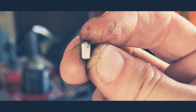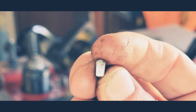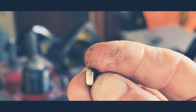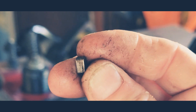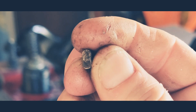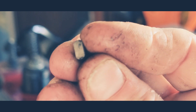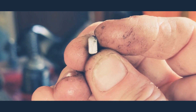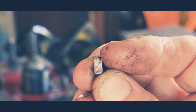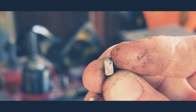This Woodruff key is oval and it fits into an oval hole. It doesn't go in the square way — it goes in the oval. You'll need to be certain to get the orientation right or else the gear will not fit on the shaft.